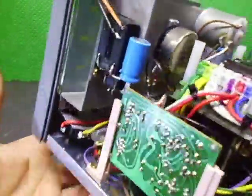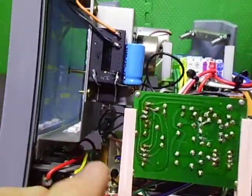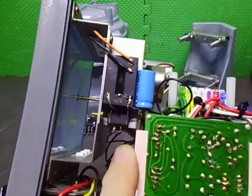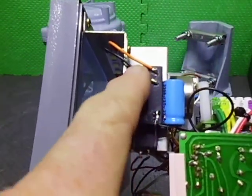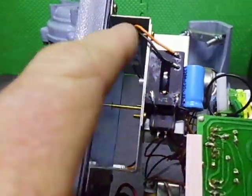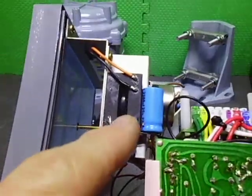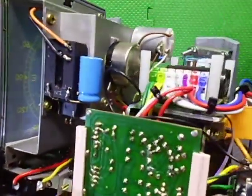I'll come around over here. We have a standard PC board and its mounting brackets here. We have my LED power supply here, bridge rectifier, capacitor, and basically a buck booster. And it can actually take 8 volts, which is supplied to the normal lights, and convert it into 12 volts, so stepping up. So I use those a lot in these particular ones.